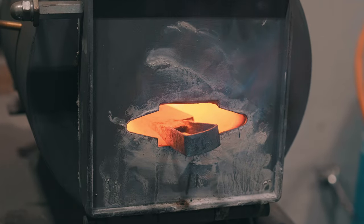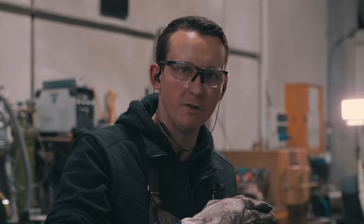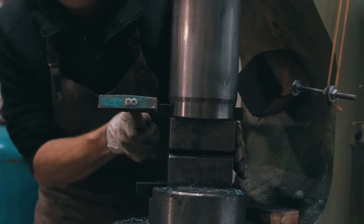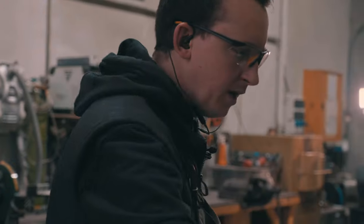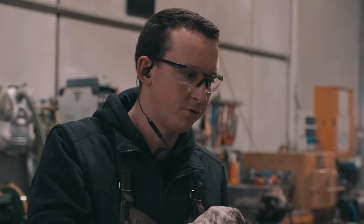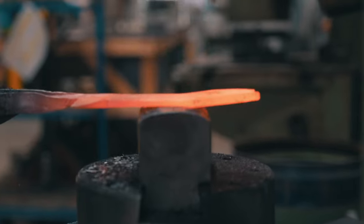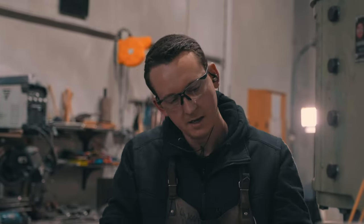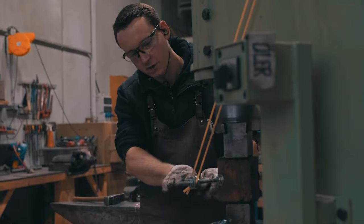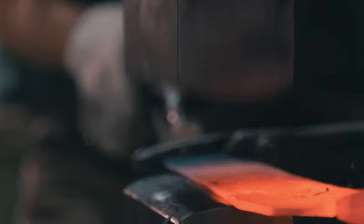For the blade forging I'm using two half-round dies, which will draw the steel in a certain direction — similar to the peen of a hammer. They are half-round and parallel to each other, and they make sure to draw the blade only or mainly in that direction. So I can forge the blade lengthwise if I hold it one way, or forge the height of the blade if I hold it the other way.